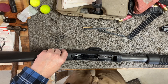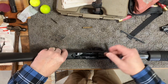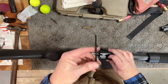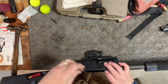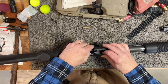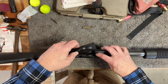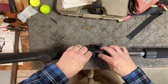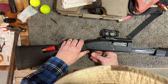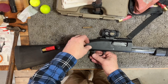And then our trigger. This is your right slide stop, and then this is your left — your left will have the little button on it that has to go through the receiver. This is the trickiest part really: holding these both in place while you're getting your trigger assembly back in place, because invariably you end up catching on something. There are some little lips here you have to clear. It went in the first time — can't complain. Now we have our little hole there; make sure we're lined up to retain our trigger assembly. And look at that — didn't even need to tap it back in. So we're all set.